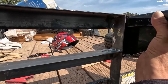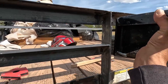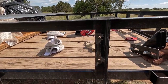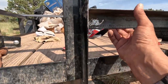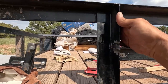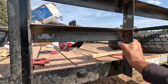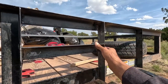Now I can mount my spare tire carrier on here just like that and the tire sits right there. This time I'm going to drill right up here through the corner of all this angle iron where it's the strongest. Last time they just drilled right in the middle and I don't think that was enough. Live and learn and do better. What they had was quarter inch — actually three-sixteenths — and I'm using eighth inch, so it's just a little bit thinner but it's going to be plenty strong enough, especially going through up here. The support is going to add a lot of side strength.